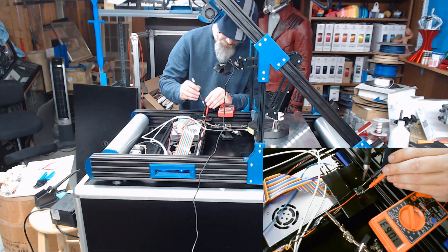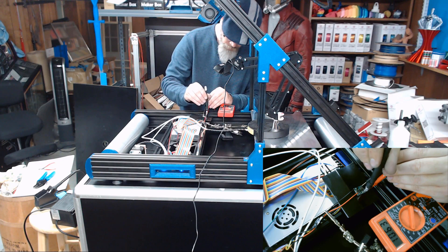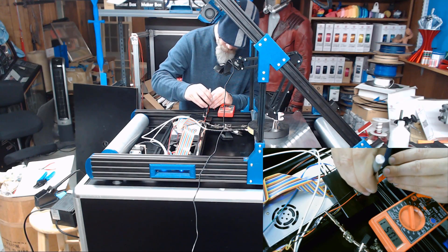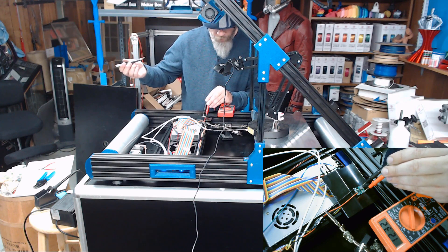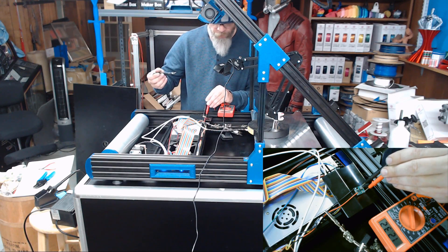I should get a nice little fancy adjustment tool, but I don't have one — I broke the tip off on my knife here. Turned it the wrong direction at first, but now it's reading 12.32 volts, that should work pretty good. I think those fans are rated up to 14 volts, so I'll go ahead and run it right there. Now we know the voltage output is good, we can go ahead and hook this up in our bottom cover and wire up our fans.